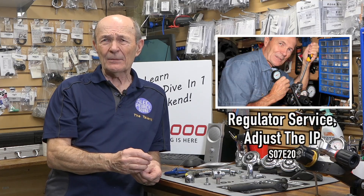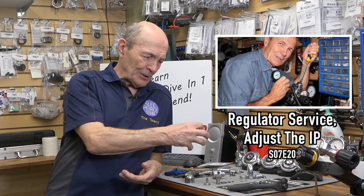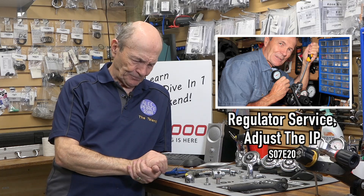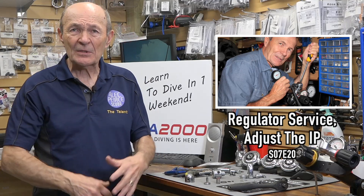People say there's supposed to be a certain pressure — 145 or 150 PSI. Yes. If you look at some of my earlier videos, we talk about using a gauge to read the intermediate pressure coming from the first stage. If you have one of those gauges, you can check it. If it's 140, 145, 150, 155, 160 — if you're somewhere in that range, leave it; it's working perfectly. You'll make your final breathing adjustment at the second stage.